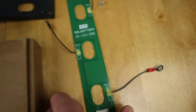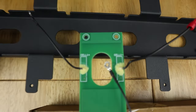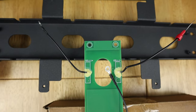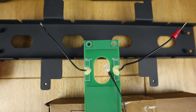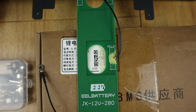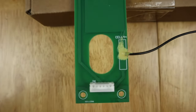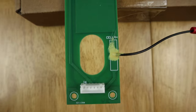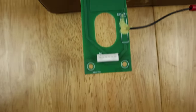Here's a close-up of the JK BMS circuit board. One thing I wasn't entirely sure of was which way around to orient the cells, but the board actually marks it up — cell one positive is on the left, negative on the right, and you flip the batteries to connect them in series. So the positive for cell four is where the leads come out. No need to refer to any diagrams — it's four cells and it's easily done.